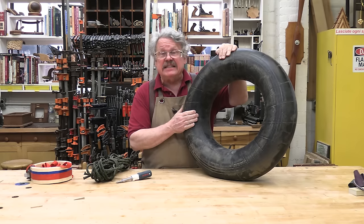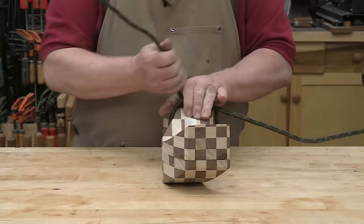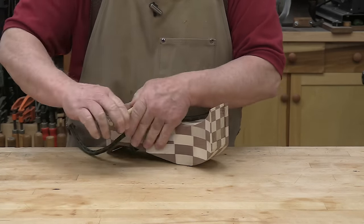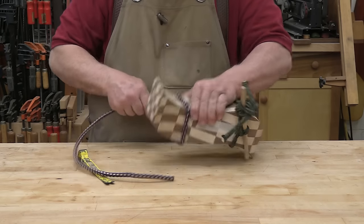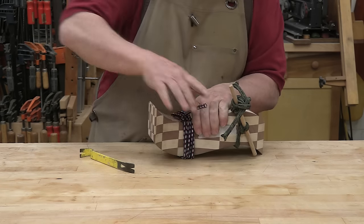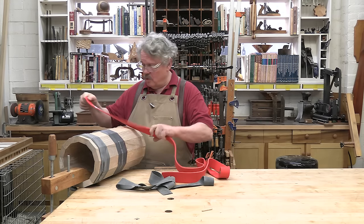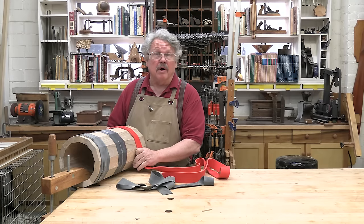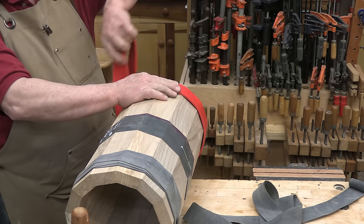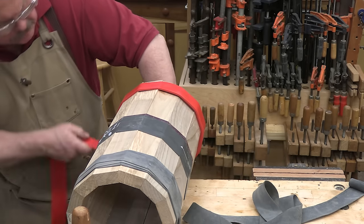You can even make your own band clamps from rope and stretchable materials — rubber, latex, elastic are all fantastic for clamping odd shapes. If you're using rope, tie it loosely around the assembly with a square knot and use a stick or a dowel to twist it tight like a tourniquet. Or take a length of surgical tubing or bungee cord and wrap it around the assembly. The more you stretch the cord and the more wraps you make, the more clamping pressure you increase. I prefer a flat elastic clamp to round ones — a flat clamp has more contact area so it better holds the wooden parts in alignment and better conforms to odd shapes. I used to make clamping straps by cutting strips from an old inner tube; these days I just use rubber or latex exercise bands.